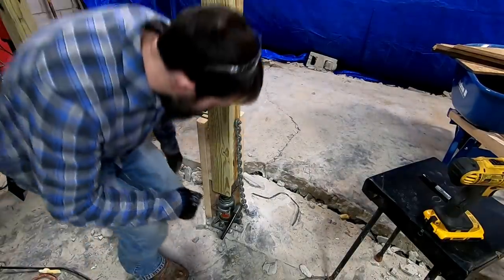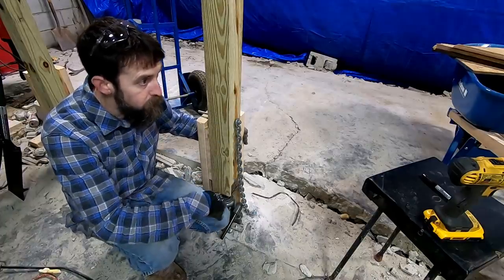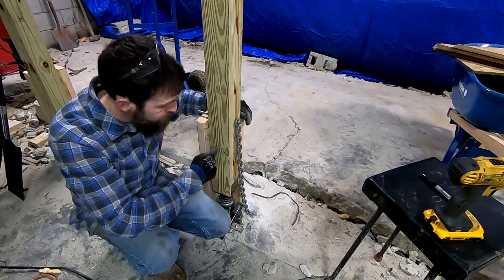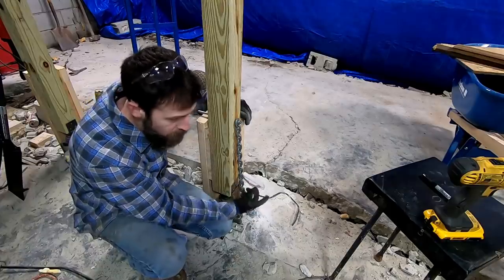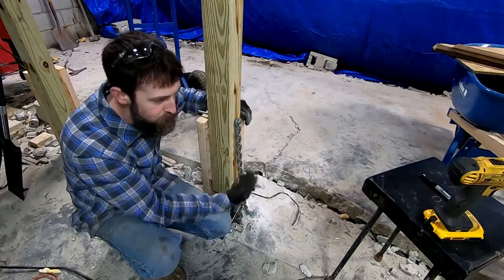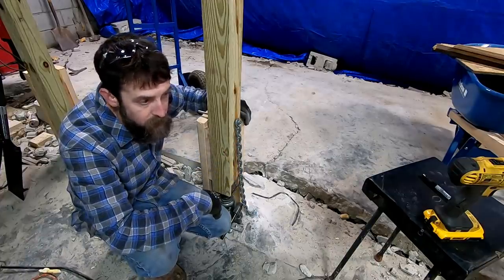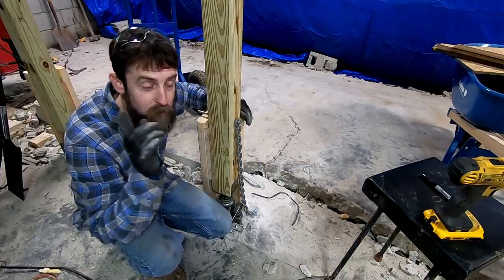So with this wall out, this roof has really become a big sail, and in order to keep it from lifting or blowing off, I've got chains, concrete anchored, 3/8, 16 stud, running through the 4x4 here, and about 8 places down through here. So it's not going anywhere, and on several of them I've got turnbuckles to tension these chains just to keep it from getting that initial movement. So chains all the way down through here, I think, will be plenty good enough to keep this thing from taking off. Not to mention, the roof's bolted to the rest of the building.